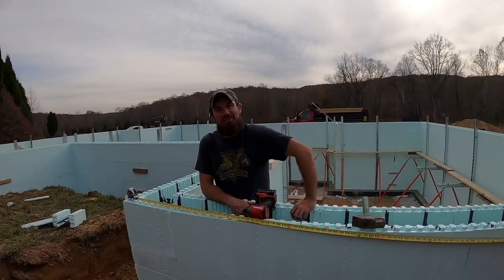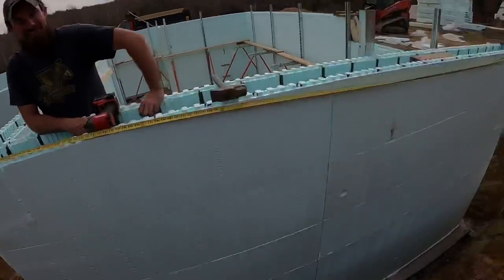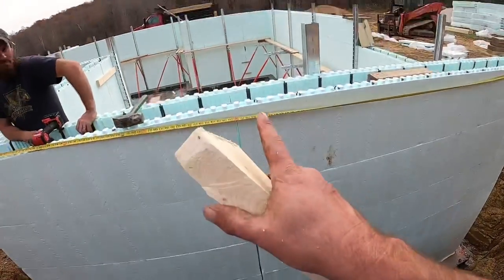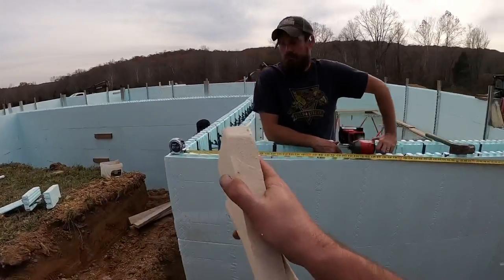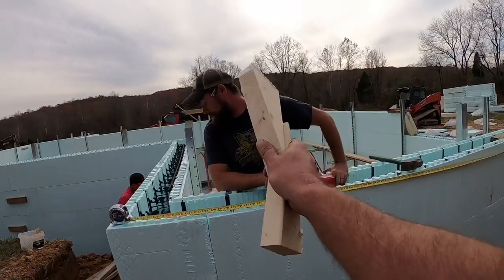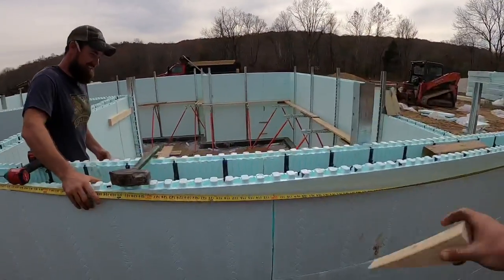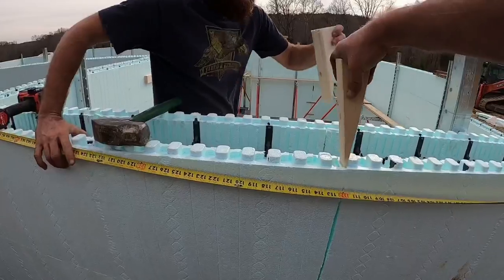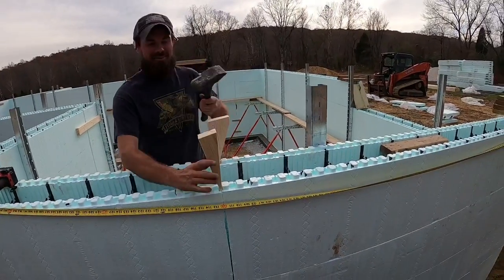We're 1/2 inch short. So this is why we check measurements top and bottom on commons. Because by the time we got to the top of this wall, this distance was 1/2 inch short. I do not have braces in this wall to push it out, so this is what you use. A wedge-a-me. Shove that down the crack there. And then use a hammer? Use a hammer.